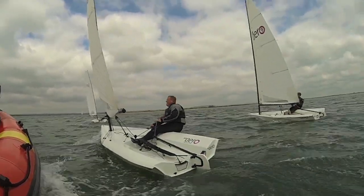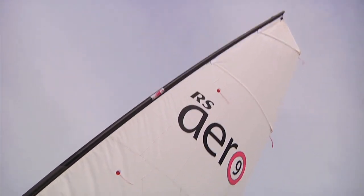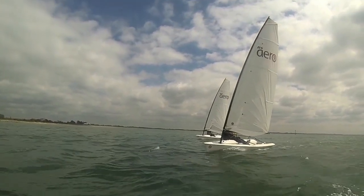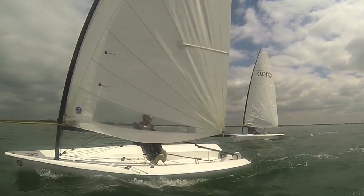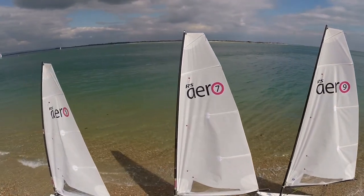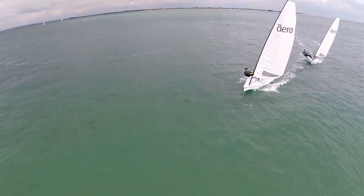People perceive nowadays that you must have a Mylar sail. But when you've got an unstayed carbon rig, there's a lot of difference in bend in different conditions and different points of sailing. A Dacron sail that stretches across the bias actually accommodates different mast bends while still keeping the same sail shape. A Mylar sail is very locked up — you can make it quick in one condition, but it's never going to work right the way across the range.